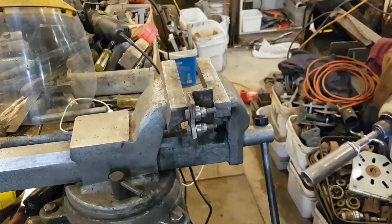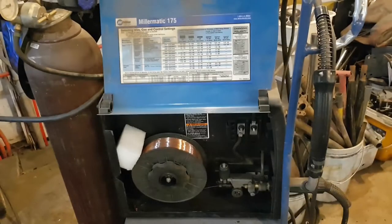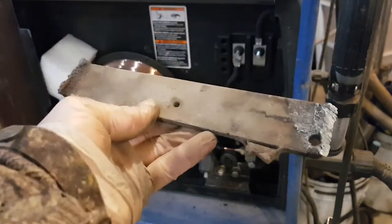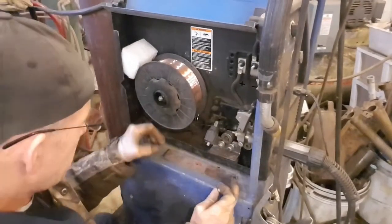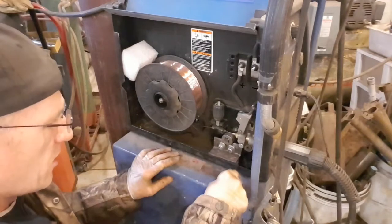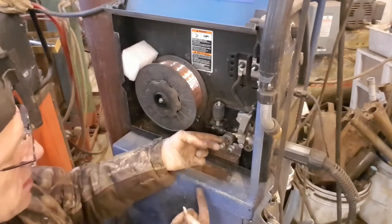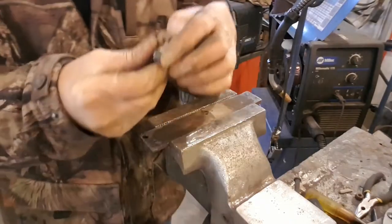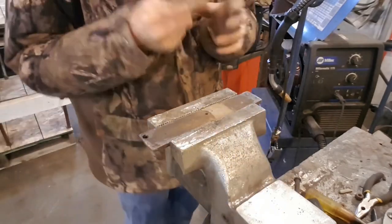Spin's nice. Alright, color good. Looks like we need about a nine-inch piece of something. It's only eight and a half inches, but that'll do! Now we're gonna mount that sucker onto here. We'll go right to the end, weld a nut over here, then a bolt — the bolt will drive against the bottom of the housing and push those wheels up against the drive wheel. I have a little bit of adjustability. Square nuts! What I usually do is put a crusty old bolt through there so that when I weld it, it doesn't wreck the threads.